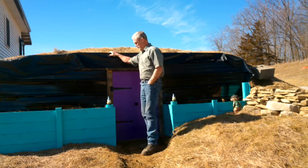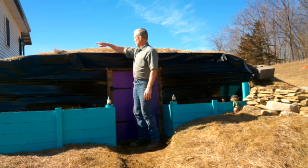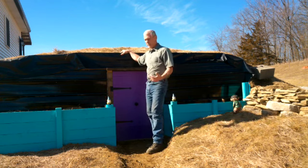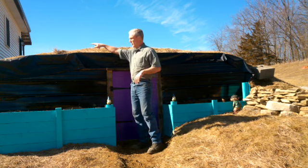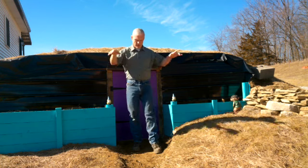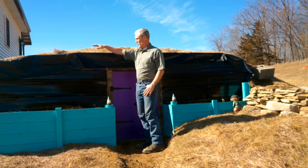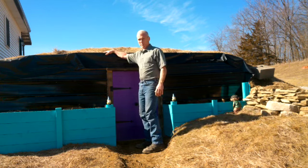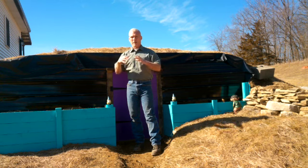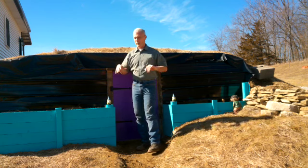The roof is made of utility poles. I took utility pole posts — three posts on each side, one in the front, one in the middle, one in the back on both sides, and two posts down the middle. The posts are set on a footer. On top of the posts on the edges I've got a 16-foot utility pole, and down the middle a 10-foot utility pole. From all the way across in one 14-foot swath, I've got 22 utility poles that comprise the roof. Where those utility poles sit on the beams, I notched them with my chainsaw so they sit down onto the beam, kind of like you would do with a log home. That keeps everything locked in together — no shifting or rolling.